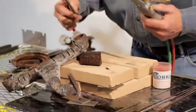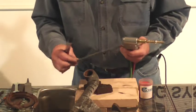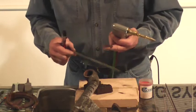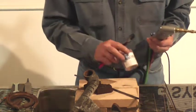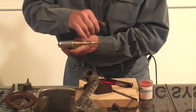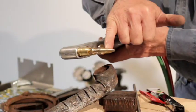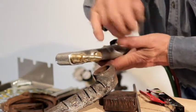Now we're using a cast rod. You can also use a cast iron piston ring if you have access to them. If you run out, these rods — a lot of places don't carry them, but your dealer should have a good supply. Remember, you're going to have to use a good high-heat flux; Cobra has an excellent one. Now we're using our number two tip. Anything over an eighth of an inch, use that number two tip. If you're doing real thick stuff, we recommend our optional 2.5 tip.